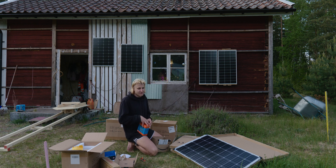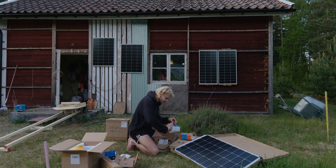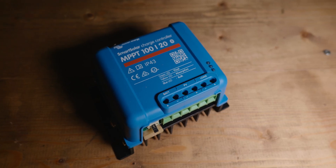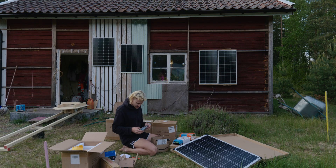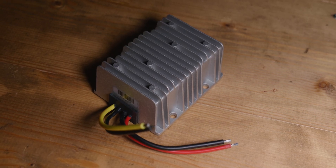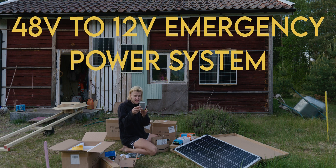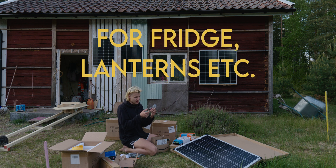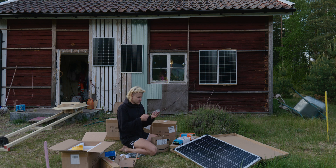It should work on a 48 volt system and it's good for about 1,100 watts of solar, so the four panels should be well within its limits. These four solar panels will charge through this MPPT to the BMS and the batteries. I also bought a DC-to-DC converter — it takes 36 to 60 volts in and outputs 12 volts at up to 30 amps. So if you have a 12 volt system like I do, you can have two wires go to the big battery and two wires to your lower voltage system.